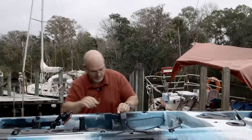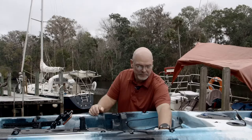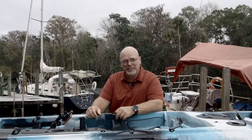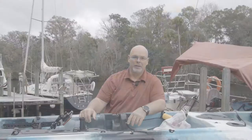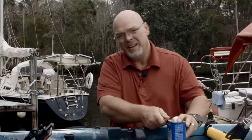The last thing we want to look for is holes and imperfections in what we've done so far. Now that you've got that done, go back and sand it again, then clean it up. You're going to do this until you feel it's flat enough — just wash, rinse, repeat.